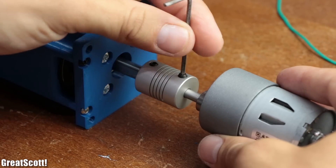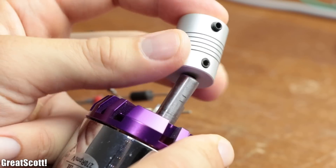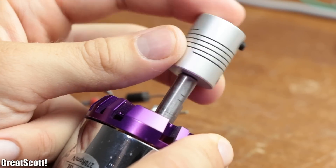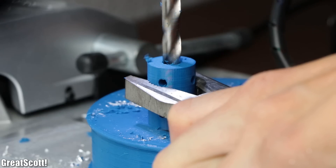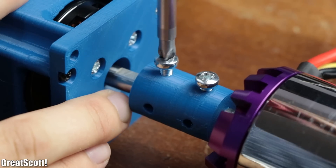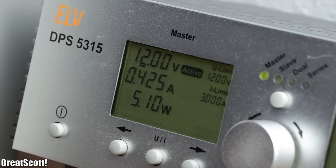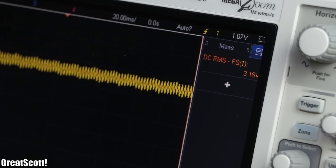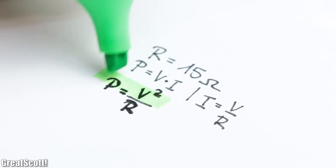For the DC motor and the stepper motor it was simple, since I had an 8mm to 5mm shaft coupler. But that would not fit the BLDC motor shaft, so I downloaded another shaft coupler from Thingiverse, 3D printed it, enlarged its holes to 8mm, and mounted it onto the BLDC motor. I utilized duty cycles of 0.1, 0.15, 0.2, and 0.25, and recorded the input power of the motor and the output voltage of the generator across the resistor. Since we know the exact resistance value, we can later easily calculate the output power.